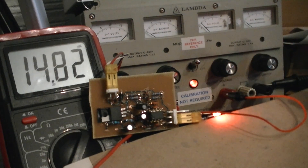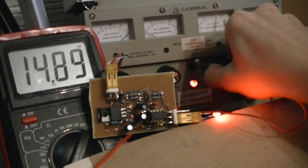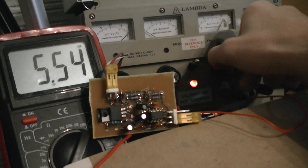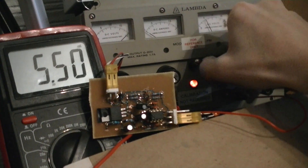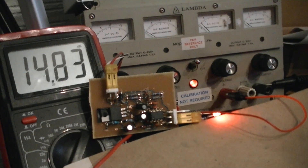And there, the switching power supply would be turned off. There's a hysteresis — if I go back up, you have to go all the way back down again to turn the power supply off. So, this should eliminate any kind of hiccuping in your system.